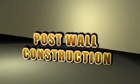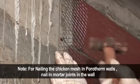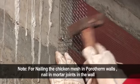Post wall construction, the walls have to be plastered. Before plastering, chicken mesh is required to be placed at the junction of RCC and the brick, since the mesh acts as a micro reinforcement preventing cracks. Plastering should be done with splatter dash and two coats. Splatter dash should be done onto a slightly wet masonry wall in a thin liquid coat to form a layer of uniform suction properties for better adhesion of the plaster. After a minimum curing of one day, the second coat of plaster should be applied, and the plastering should be a minimum thickness of 10 mm.